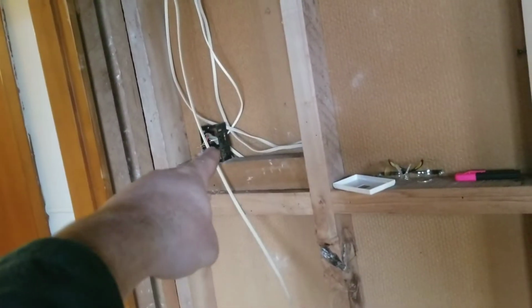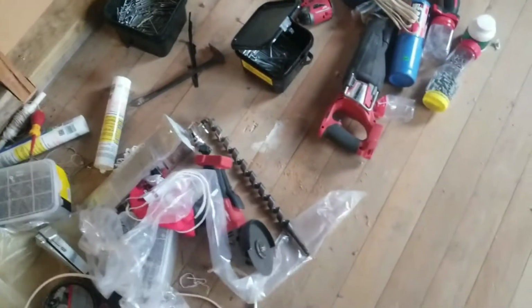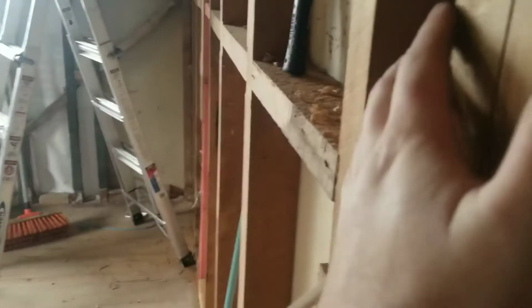It's not that hard to change which way the door swings in and out. So last minute decision, we're taking a light switch and moving it to here. And just like that, just move it over to here. And this is why you have a little bit of extra slack if you even need to change stuff. That hole up there though, on the angle, real bastard, because there's like 4 nails in that spot. So even though I've got a nail biter auger bit, didn't like doing it. But we got through, and that's going to sit flush, and that's just a little nicer so that when you open the door, say goodnight, turn it off, it's right there.